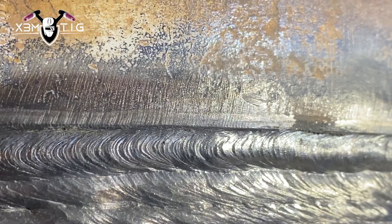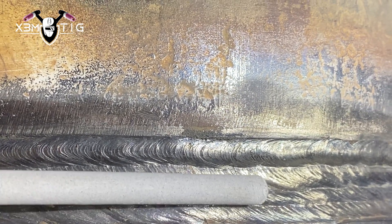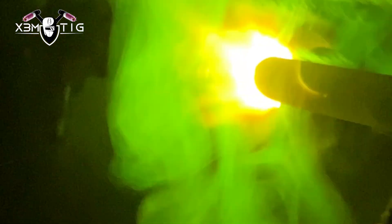Three passes with the quarter inch and it's pretty much almost filled to flush. On the top there's that shoulder, which I fill up with a 5/32 rod — now it's pretty much filled to flush. With the quarter-inch rod you'll fill all those uneven spots easily. Start properly with the first pass, second, third — it's gonna be probably six passes all together. Remember: lower inclination makes your bead wider; higher inclination, even up to 90 degrees, makes your bead shape smaller and it'll blend in nicely, especially for horizontal — you don't want a big buildup on your cap passes.